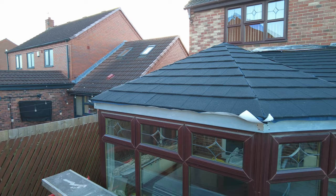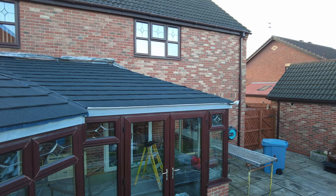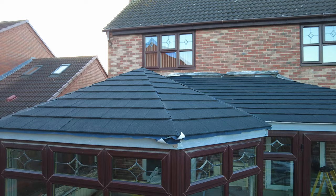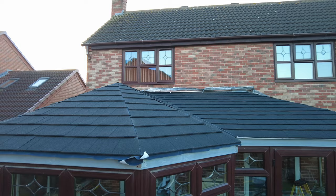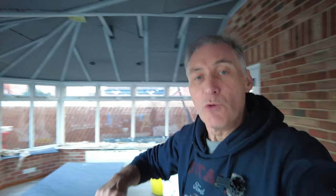So that's the end of day two. They've done a lot of the tiling, but they haven't done the edge cappings — or ridge cappings — that go down the sides yet, so we're not fully waterproof yet. No rain forecast tonight so that should be fine. We've still got the leading to do at the top edge, plus the fascia boards and the guttering to go along the edge. The electrician has been in, and tomorrow we've got the plasterer coming to install the boards on the inside of the roof, ready to plaster. The guys should be back to finish off the rest of the roof — that'll be day three. The plasterer is likely going to start plastering Thursday or Friday.